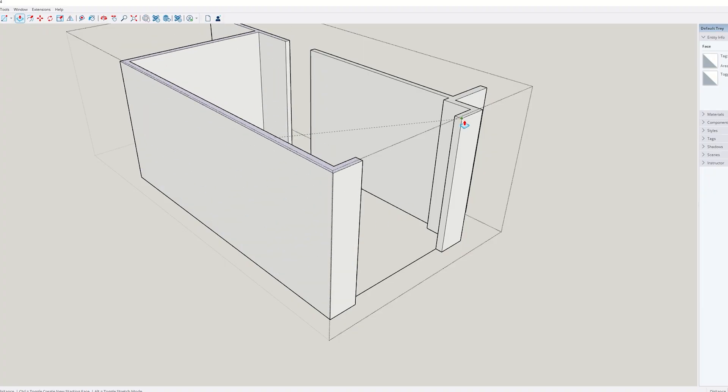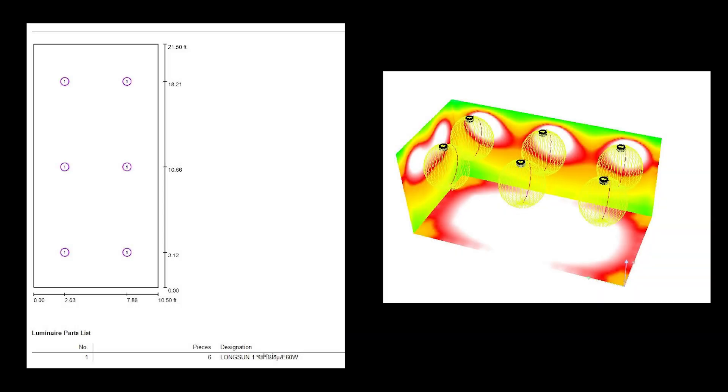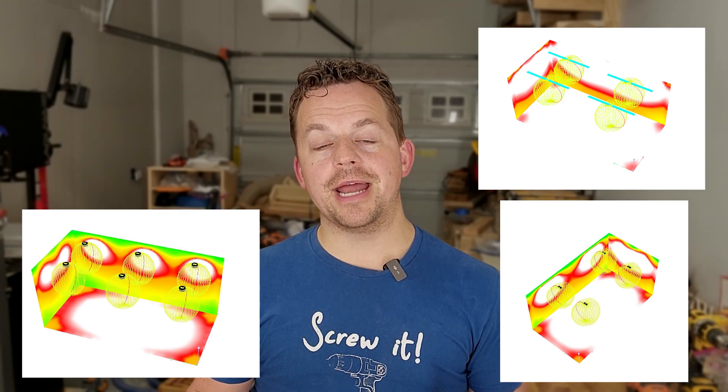You don't know where the foot candles are actually going to be in your shop until you install the lights, because there are so many factors — white walls, shadows, and so on. What most companies will do is take the overall dimensions of your shop — length, width, and height — make some assumptions about your environment like white walls or workbench height, and give you a recommendation of what light fixtures would meet the lighting requirements. Hyper Light does this as a free service, so I sent them the dimensions of my space and they gave me a full lighting analysis. This was really helpful as a starting point, but I had some other things I wanted to add based on what I was going to use the space for.